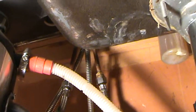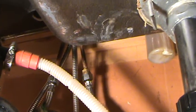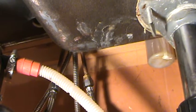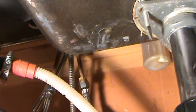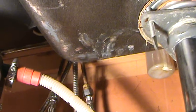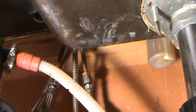That brass nut on the copper is just to hold it — that's why it's there, that's not to turn. I'm going to try to tighten that nut and see what happens. Generally that's all that's needed; it's probably just a hair loose. I've got to hang onto that top nut really tight so it doesn't start twisting that copper tube up there. If I don't hold that and try to tighten the bottom one, I could twist it and kink something above and spring another leak — we don't want that.